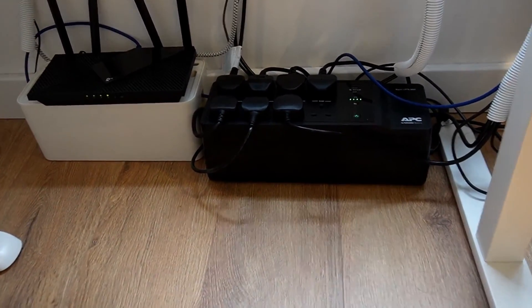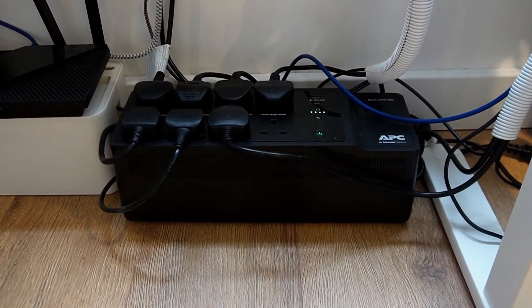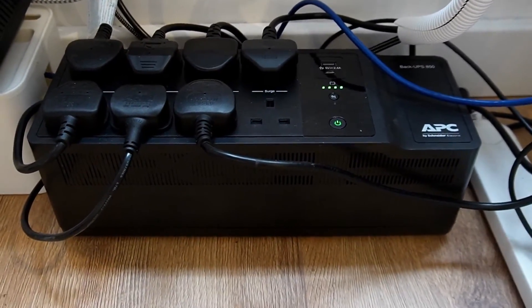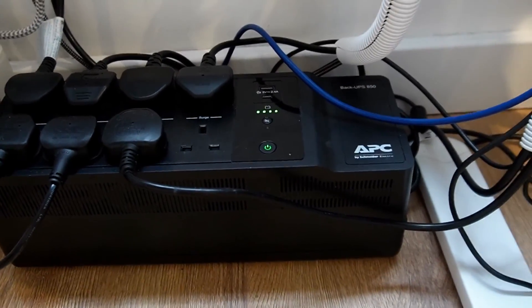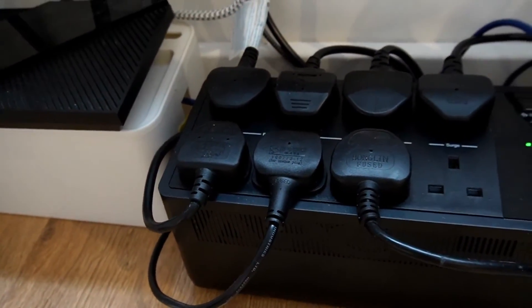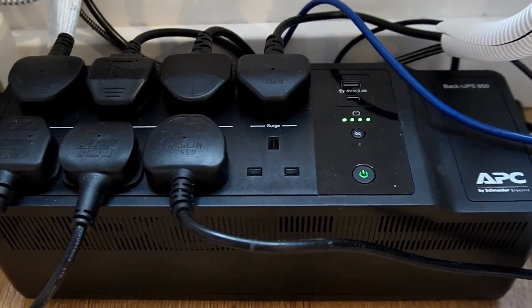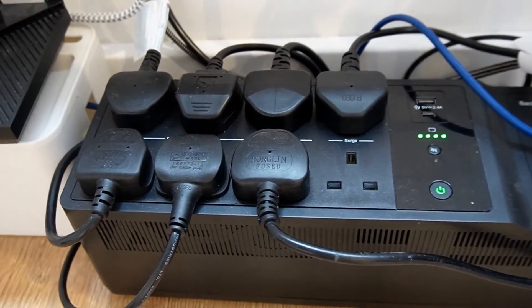Under the desk, next to the router, I've got a UPS unit. I recently had a few power cuts which was unexpected, and one of the things I really didn't want to have happen was the hardware getting damaged because of that sudden loss of power. So I put most of the items from my home lab through this UPS. This is an APC UPS from Schneider Electric — the Back-UPS 850. It's got six sockets for redundancy, so the battery will kick in if I lose power for those six sockets, plus two surge protectors. We get an audio warning if the power goes out, it keeps all the servers running and gives me enough time to power down machines gracefully.